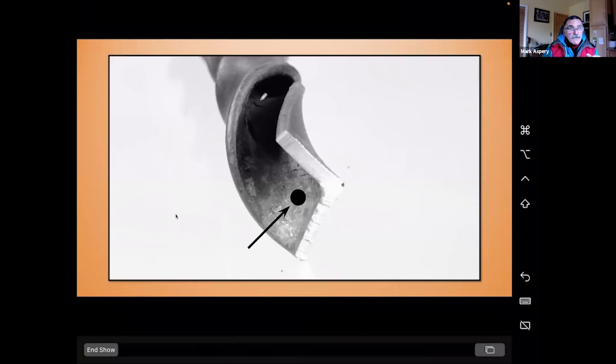And then when I look at some half round bar, you can see that that is going to look very similar to that corner section of the angle iron. So our half round bar that we just made is going to act in a similar manner. Now I've drawn this as a crescent, not as a half round, and that is true. Now that we've made our half round, I want to come back in and just hem that edge slightly, and you can see by the top right photograph that it is slightly cut, more of a crescent shape. The reason I've done that is because of the angle iron edges deflecting outwards when you twist.